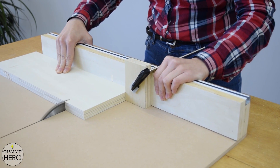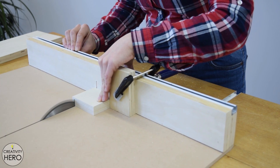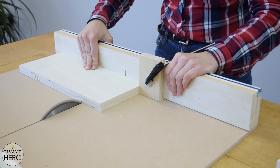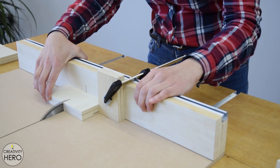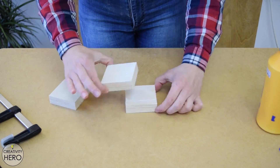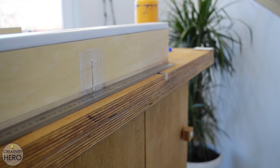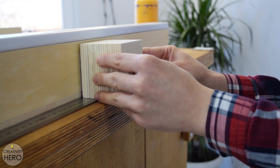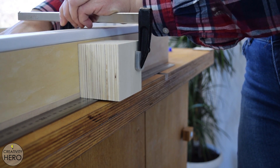When making cross cuts, the blade is protruding out of the back, which means I need to make a blade guard. I am going to make the cuts on my new crosscut sled, cutting 3 squares out of plywood using a temporary stop block. Then I am joining them together with wood glue and attaching this guard on the front fence. This block will act as a reminder to push the sled from the sides of the block and not the middle when making cross cuts.